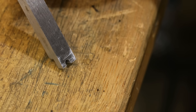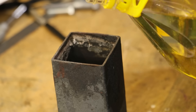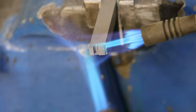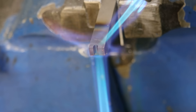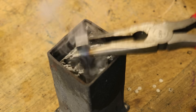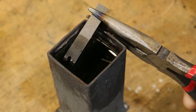After the first cut is done, I'll angle the tool post a little bit and then take a second cut to add clearance to the cutter. And that is the negative profile cut. With the negative now done, we can go ahead and harden it. Because this is O1 tool steel, I'm going to use canola oil as a quench oil. It's not perfect and it does leave a bit of residue, but it'll be more than good enough for this sort of tool. It's best practice to get it red hot and then let it soak at that temperature for about a minute, which allows the austenite to fully form. With it now quenched, I'll pop it in the oven.